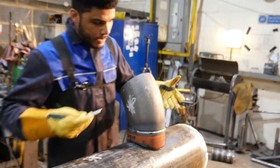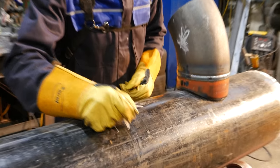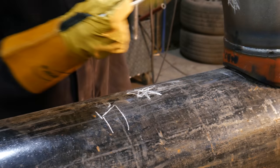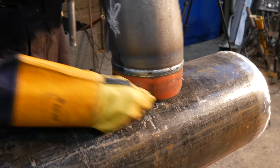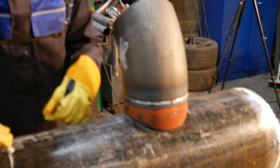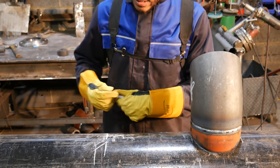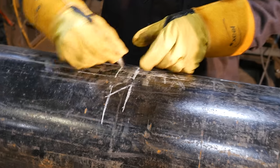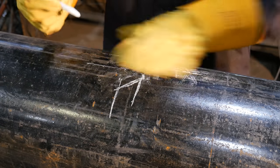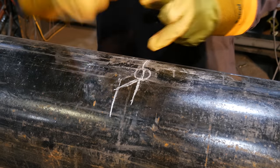When I'm marking it, I like to get up into the prep. Instead of putting the chalk line here on the outside, I like the chalk line to go as far in as possible. It makes your root come out nicer — if you mark on the outside and it ends there, your root comes out in a weird way. By bringing both edges nice together, your root lines up perfect.